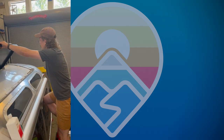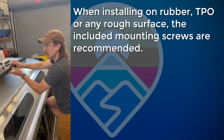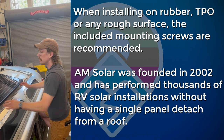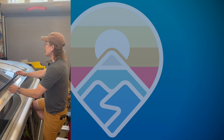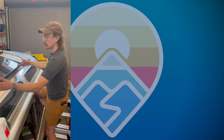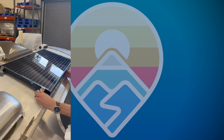The panels are mounted on the white part of the Airstream roof. I would never suggest putting the feet on the silver part. If you have feet on the sides with some of the mounting hardware we use, you can extend past it as long as the feet are within range to support the panel enough — you can kind of cheat across a little bit — but never put the feet on the silver.